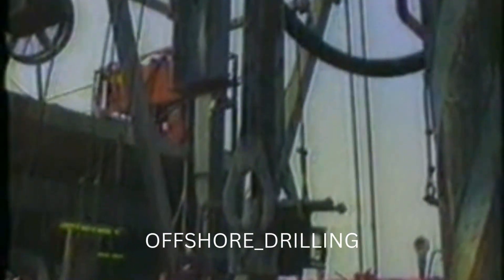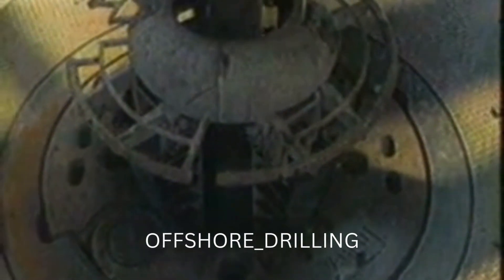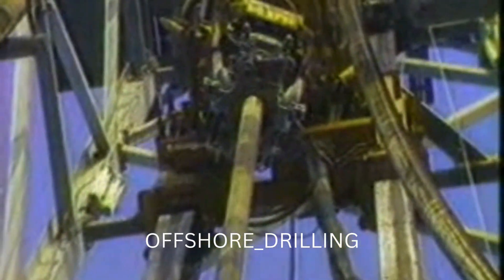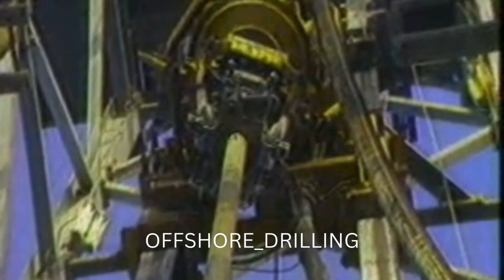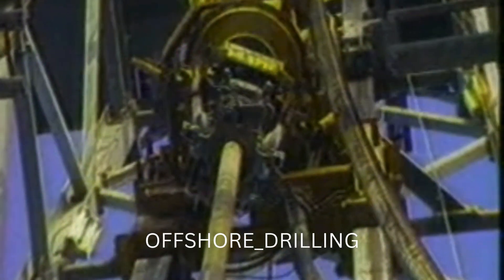This is the Varco power sub drilling system. Designed to rotate the drill string by means of an electric motor and gear drive suspended in the derrick, the power sub drilling system permits the driller to rotate the pipe while pulling out of the hole and gives him the ability to drill down whole 90-foot stands. When drilling in a high angle hole it is occasionally necessary to rotate the string while pulling out to prevent the pipe from becoming stuck in the angled portion of the borehole. Drilling with 90-foot stands eliminates two kelly connections every 90 feet, thus saving considerable time in the drilling operation.